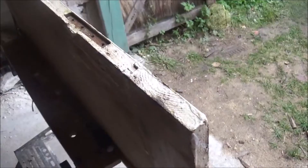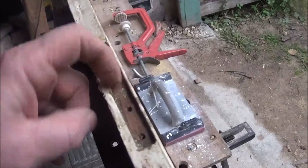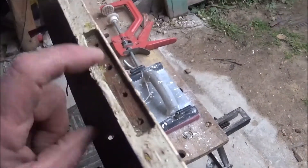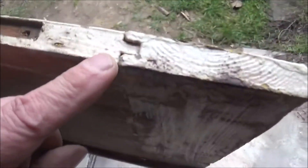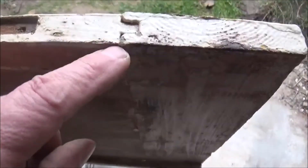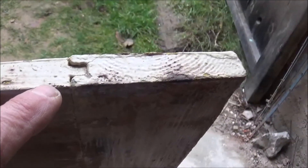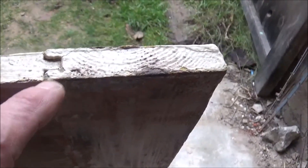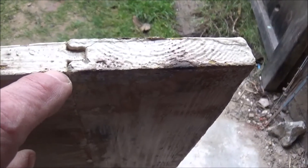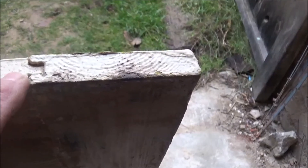Best I shut up and get on with it really. Well, that was fun. I've just pulled the hinge out of there and I was pleased about that — I got it out without splitting the wood. But I found this little problem: this is why this door didn't shut particularly well. This bottom rail is slightly too long, so we'll take the opportunity and correct that.